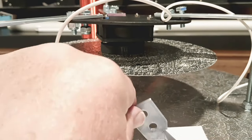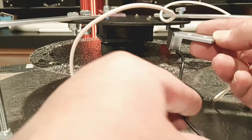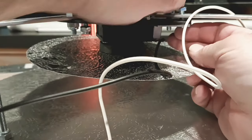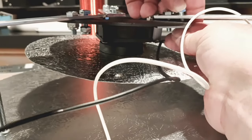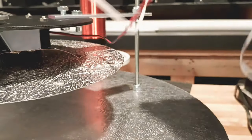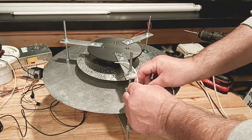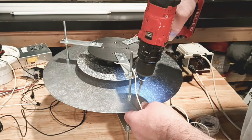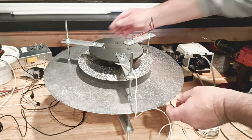We're going to hook it in right here — there's only one spot this thing can go, so it should be pretty easy to identify. All you've got to do is put it up under there just like that. You see the two bolts coming through — you put them in, you put the nut on there, and you're good to go. The little tab goes right there to the plate, and that's where our high voltage is going to go in. Now that we have our high voltage tabs in there and the wire hooked to it, we need to put a few more holes in our Graviflyer — one right here for the high voltage line. You can go a little bigger on this one, but it is sharp metal, so do what you think is best.